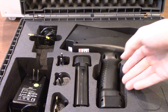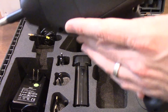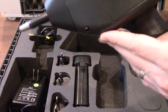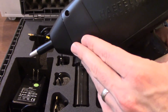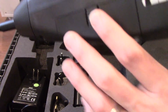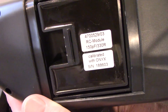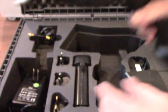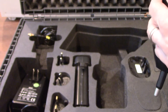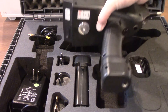Now let's take a look at the simulator real quick. One of the interesting things about this simulator is how the RC — or resistance capacitance — modules or networks are changed out. On the top of the simulator right here there's a little push button. You just push that in and it opens up, and this is where the modules or networks are placed. You can see right there: 150 pF, 330 ohm. That's the one we're looking for today. Everything's been accounted for.